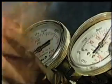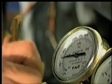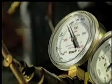Then close the regulator and wait until the system bleeds down the remaining nitrogen. Flushing the low side is the same except that the pressure on the low side cannot exceed 150 pounds. In addition to looking for a clean discharge from the cap tube, you are also looking for a good strong flow out of the tube.